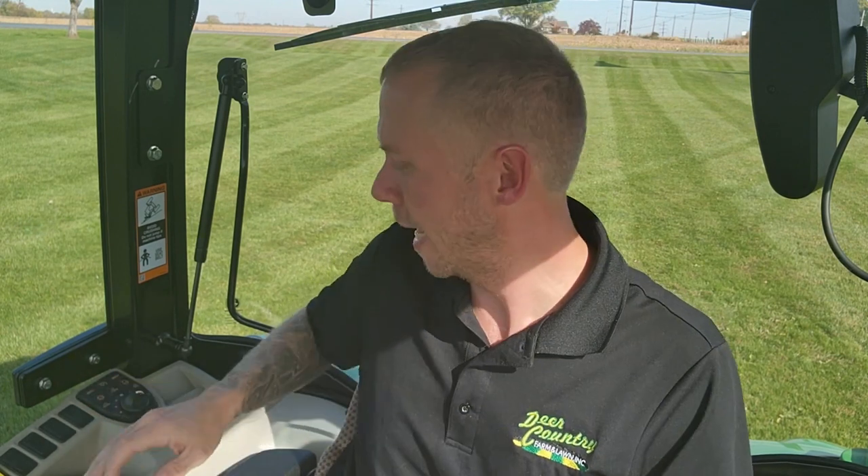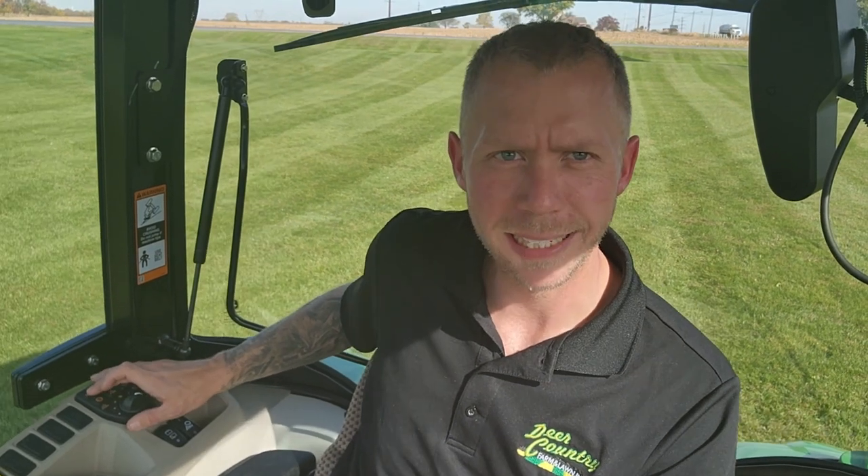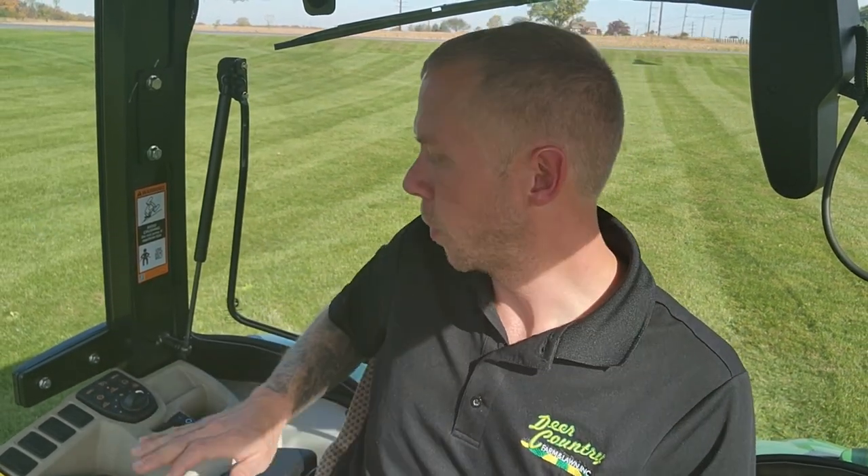What we're going to do is press that in, move forward, get going about a mile an hour or so, and hit that set button and let off. Once we have that speed match and the max forward travel speed set, we can press that forward pedal down as far as we want and the tractor will never go further than what we set — just a little bit over one mile per hour. If I press that forward pedal down all the way, that's as fast as we go. That can also work hand in hand with your cruise control, because if you are doing work where you have a set speed range but never want to exceed it, you can use them in conjunction to effectively increase your productivity.